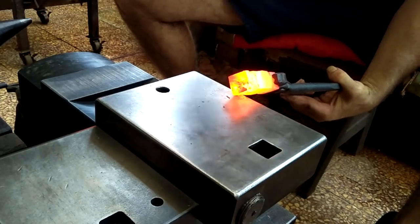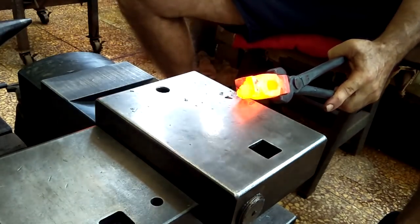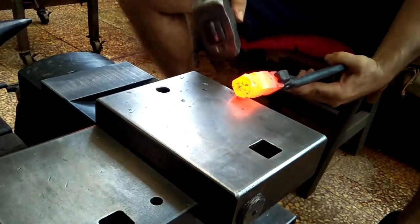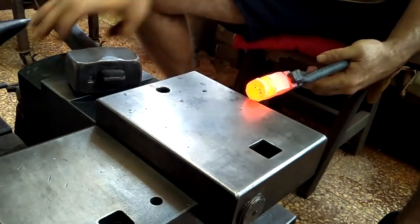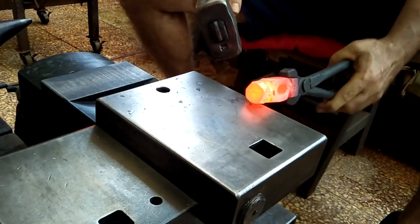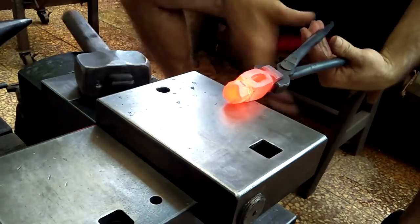Here I should have held this at a lower angle — it's starting to make the steel fold onto itself, which I'll have to correct later. Also, I'm a guy who makes tongs, but I don't have a tong that works just right for this workpiece. The two tongs I'm using are splayed a little too wide and a little uncomfortable, though I know they work.